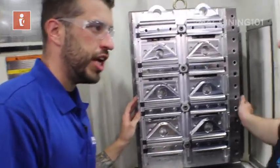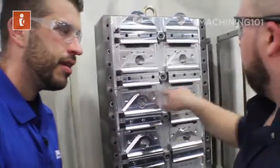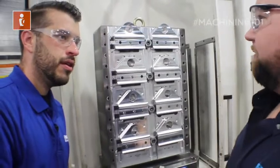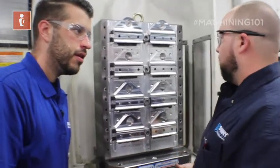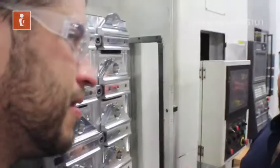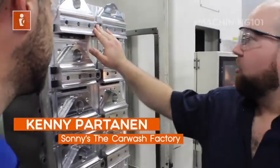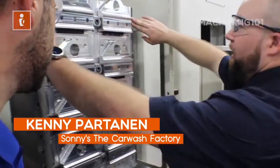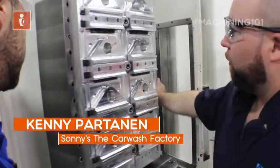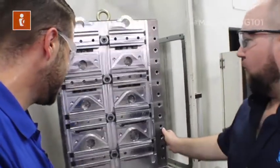This whole fixture was machined specifically for this part — it started as a solid billet of cast jig plate, an aluminum cast material. We cut in our grooves, drilled and tapped our holes, so that way we could put in locating rails, attach our clamps, and our talon grips on the sides, so we could get a lot of parts out of this one fixture.